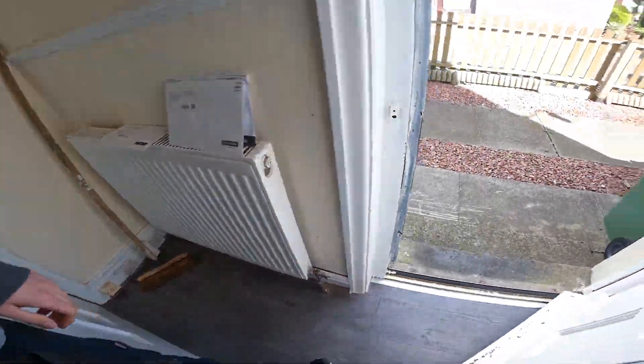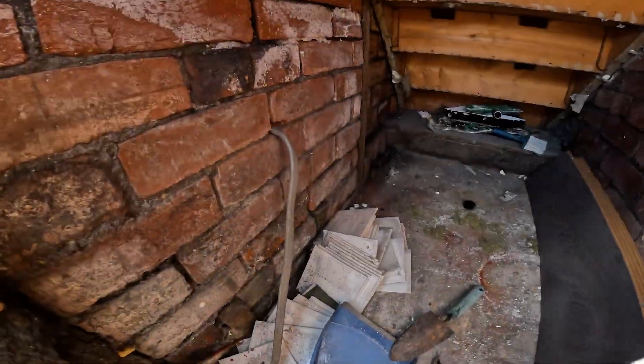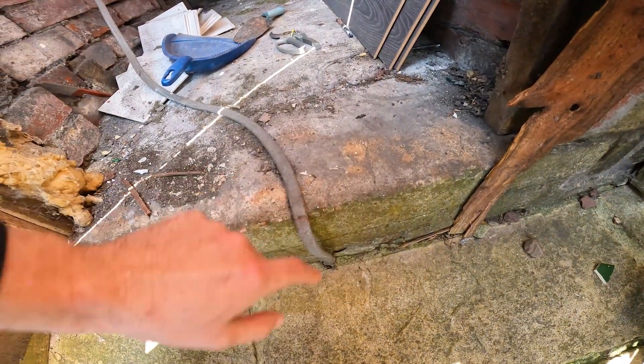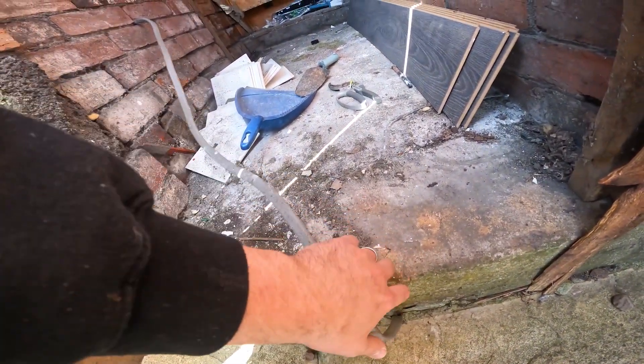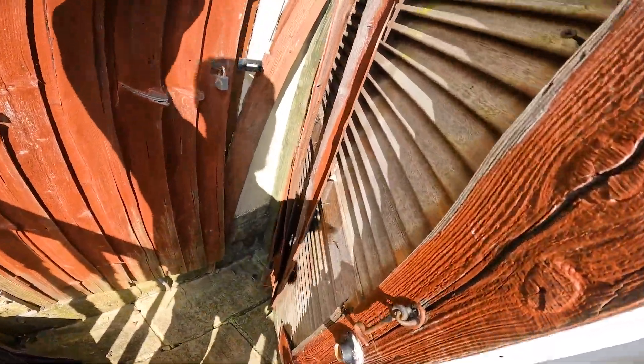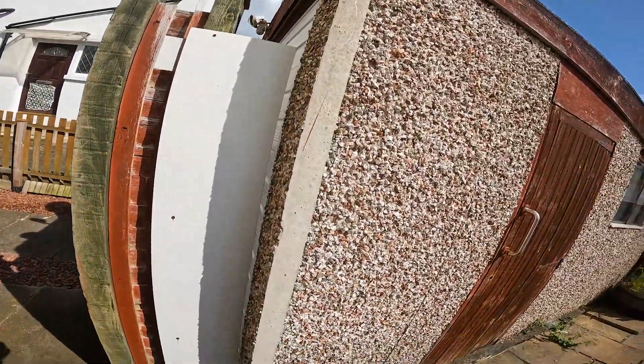It's this one here - it goes through the wall. I have no clue what it does, we'll have to chase it. We've got a whopper - look at him, goes through there, disappears down here somewhere. It goes straight through the floor with no protection on that at all. It should be in some sort of metal conduit if you're going to do it like that. But obviously this is external from this point onwards and it's not exactly clipped and secure. What we'll have to do is disconnect it and run it in an armoured cable if they want a garage supply. That's not good at all - it won't pass with that in.